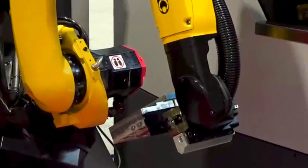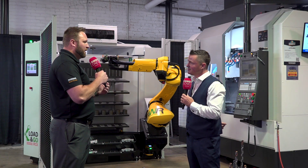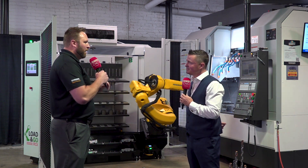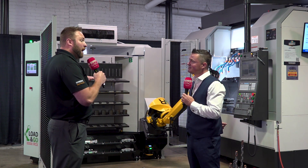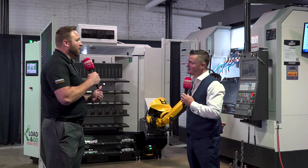These units are all designed specifically for the job shop. Why would I automate a 20-piece job? Well, you'd automate a 20-piece job because you don't have the operator standing there. You don't have your skilled labor tied up loading and unloading parts and pressing cycle start. You're able to load that job up, and the robot schedules that project on the HMI, calling up each program after going through ten pieces or five pieces and on to the next job — simultaneously and automatically without an operator being involved.